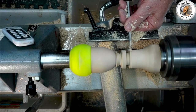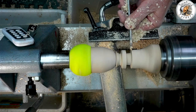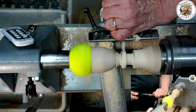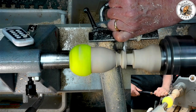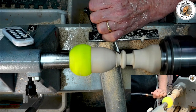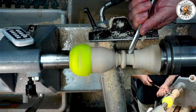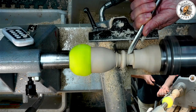I'm going to reduce the shaft down in diameter. I'm going to try and do two captive rings, one on either side of a central thickening in the shaft. You're going to leave the shaft thick enough throughout while you're doing this so that you don't get any whip and that it doesn't snap off. Now the first little bit of shaping of the outside of the ring with the 3/8 spindle gouge, and with the outside shape vaguely sorted out, start doing a bit of an undercut with the spindle gouge to start defining the underside of the ring. These are just the first cuts to remove some of the waste with the 3/8 before I swap to a pointier tool.